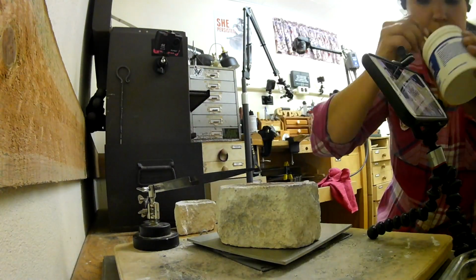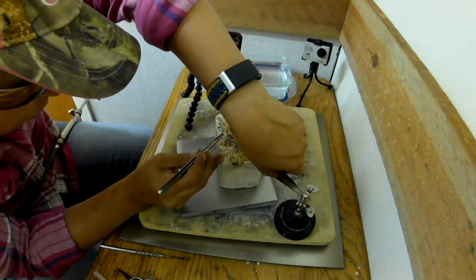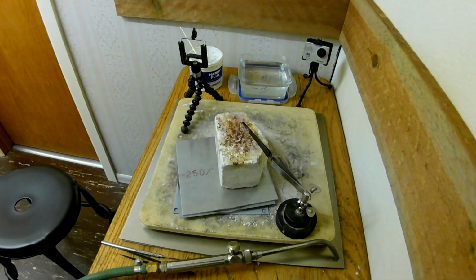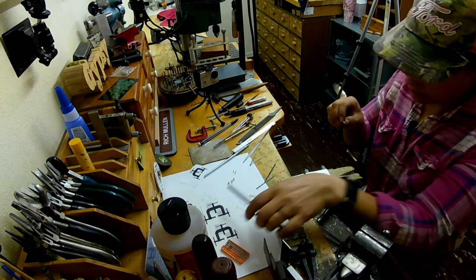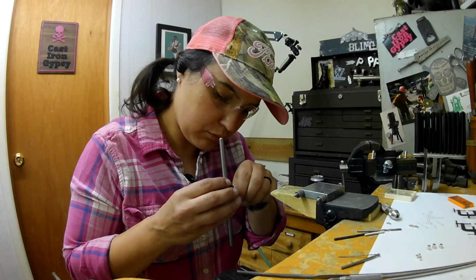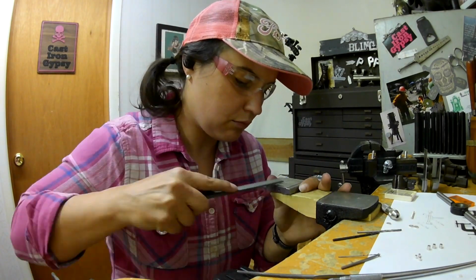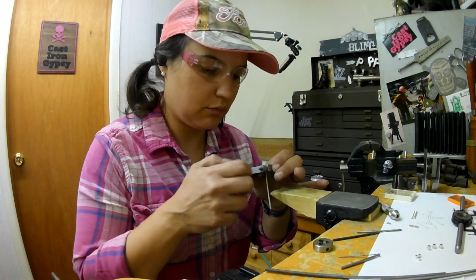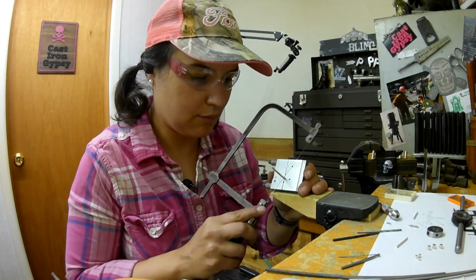But I can only solder the end cap onto one side because then it has to pass through the hole in the threaded element. And then the other side will get soldered on. All right, so then I decided to finally cut the threaded rods. And so they're definitely cut way oversized, but I'd rather have it be oversized. And then, at that point I was still kind of unsure of the final dimensions of the whole clamp back spine, and so just keeping my options open.